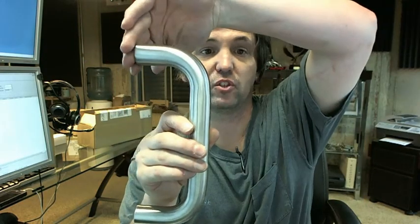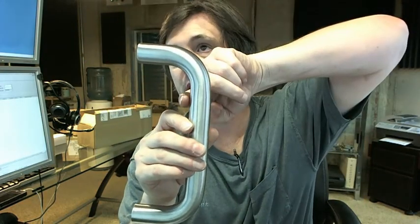You'll see pull handles like these in public commercial spaces — anywhere that's handicap compliant, like a restroom in an airport, would require a handle such as this with the 2.5 inch dimension from the face of the door to the inside of the pull handle.